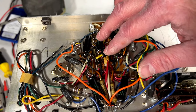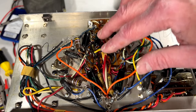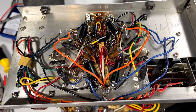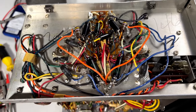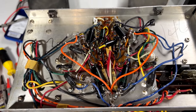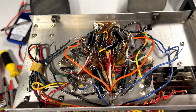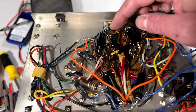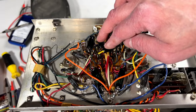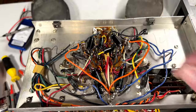these have measured, I think, something like 3.3 ohms ESR, and the other ones were 25 and 45, and at least one of them was leaking. So, physically leaking, I should say, not electrically. Well, possibly electrically too, but I fired it up after I did these two here, and the amp's got a lot more volume now. So, yeah, hopefully the rest of these are fine now. I haven't tested it since I did those two in the middle here, but yeah, should be fine.